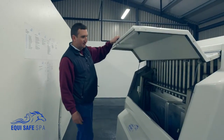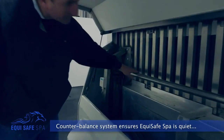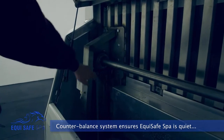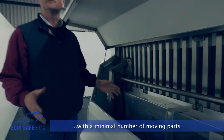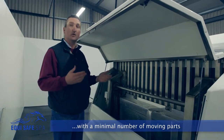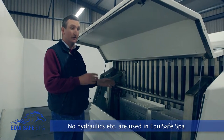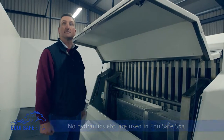Just another feature of the spa: it is lowered and raised using a counterbalance system. We have two tons of water in the spa, so we have two tons of weights on the outside. Therefore your spa is very quiet — there's no hydraulic system. We only have a small motor, and it raises and lowers the spa because it's done with a counterbalance system.